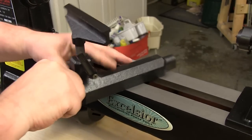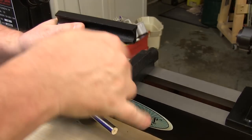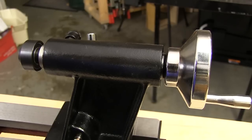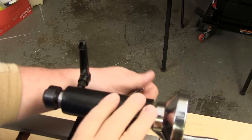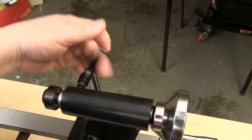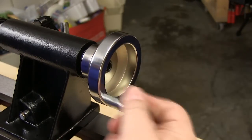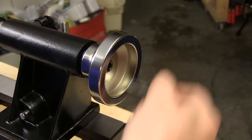This lathe comes with a six-inch long tool rest that fits into a cast iron banjo. The handle that locks the tool rest post in place is repositionable, which lets you put it where it's fully out of your way when turning, and that makes it a little safer. The tailstock is built around one very solid iron casting. The tailstock itself is locked in place with a single lever on the back side, and another repositionable handle is used for locking the tailstock quill in place.